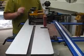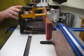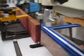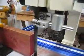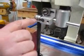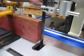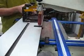The thing you should be noticing about this is a standard bandsaw, standard bandsaw blade. I am showing roller guides on here, and roller guides will work with dry wood. They don't work so well with wet wood because they will pack up, and you can see the sawdust packed on that guide already a little bit there. So away we go. It's extremely hard wood.